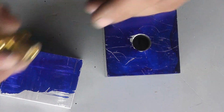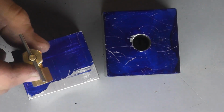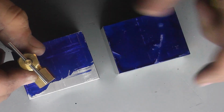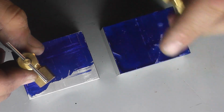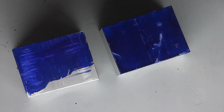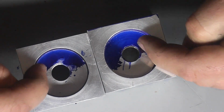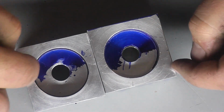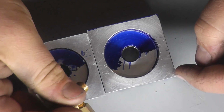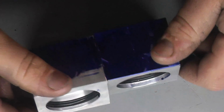Well, on the top here we have to do 2 1/8 inch MPT. One's going to be for a needle valve, and the other one is going to have a 90. And then the other side will have a plug, so we got to drill and tap those for 1/8 inch MPT. And then what we'll do is we'll just drill in from this face in to meet the bore of these, and that's how the fluid will get physically into the cylinder.